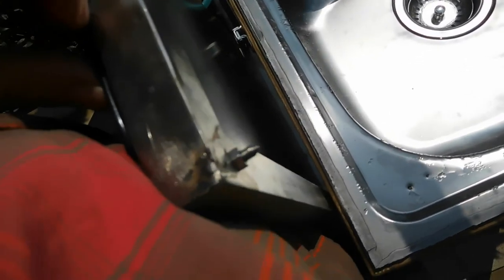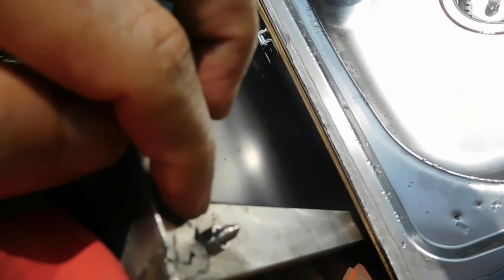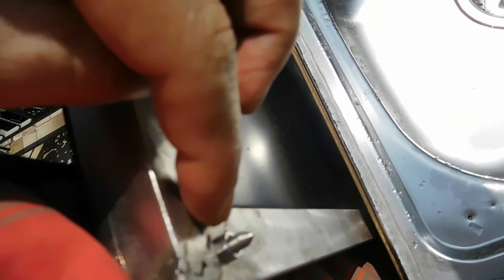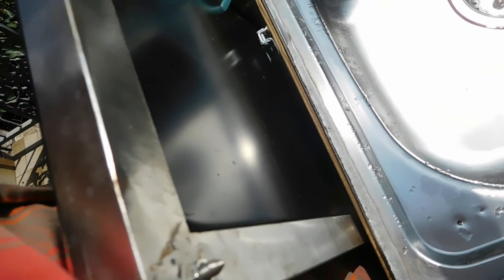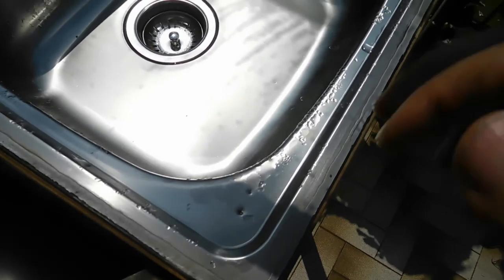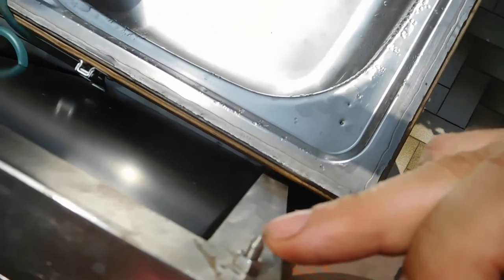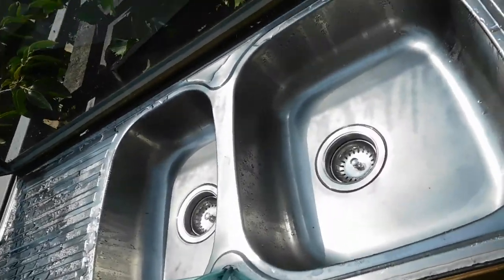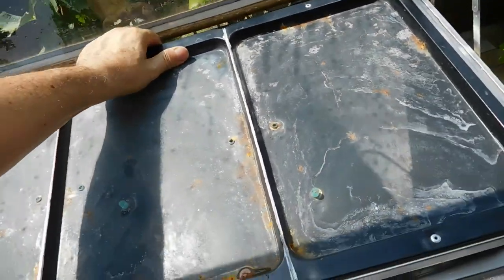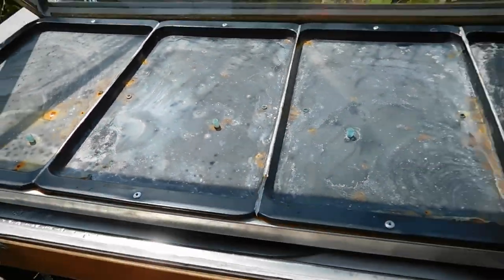And that's the little feet here. What I did was thread this frame and get a machine screw, cut the head off it — and this is a lock nut there. I adjusted that until I got it dead level, perfectly level. These fit into little indents I made — you can see these indents — and that point just gets into those. So we're ready to go again.